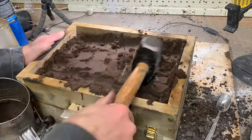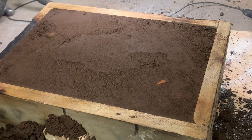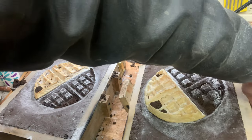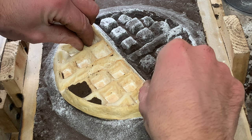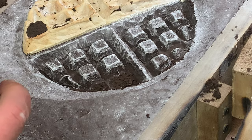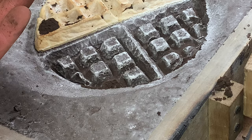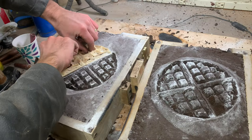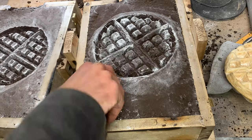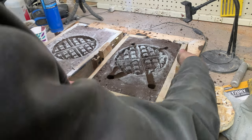I'll do the same process to the other side. I'll do my best to put those back into place — if I do it right you won't even notice. I'll remove the half of the waffle but I see some of the sand squares got stuck. I'll carve channels into the sand with a copper pipe that'll allow the metal to flow into the space of the waffle, and I'll carve some extra channels just in case I need them.